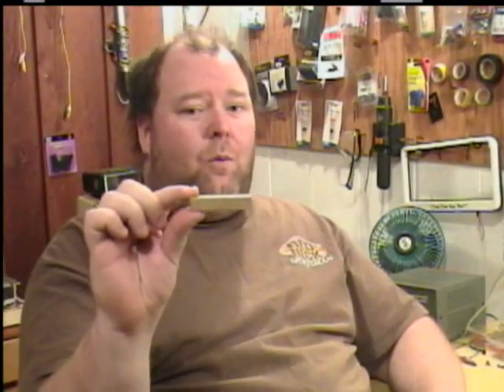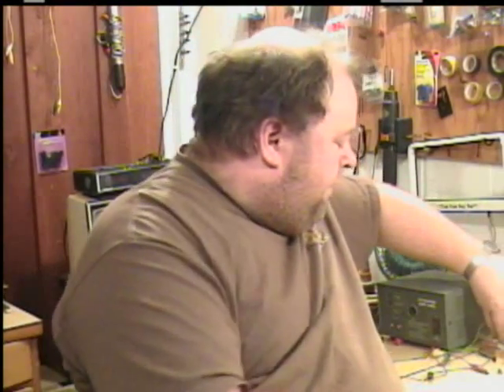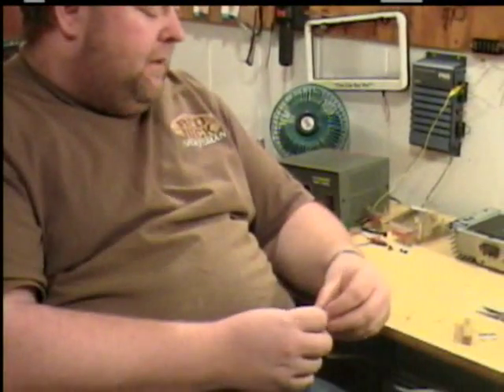For example, here is a 25 watt wire wound resistor. Inside, it's a ceramic block with a resistive wire that wraps around. These are designed for high current. You've got bigger ones too. You've got metal film resistors, wire wound resistors, and carbon resistors — all different types, but they all have the same function. Some are more high-powered than others.